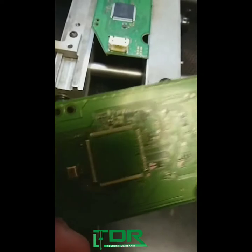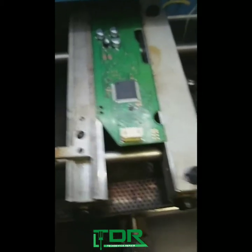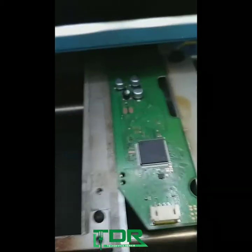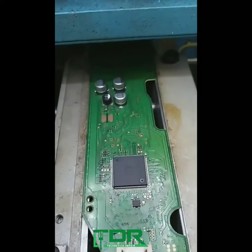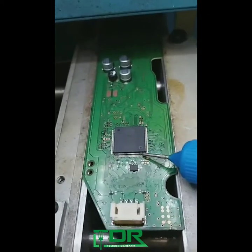What we're going to do is go ahead and remarry the chip. We basically took this chip right here off and we're going to remarry it on this one. We did the first reflow — just for the fact that it's a small chip with no flux and it's very micro so it moves a lot. I do this as a little trick to keep the chip in place, then I flux it with a no-clean flux.